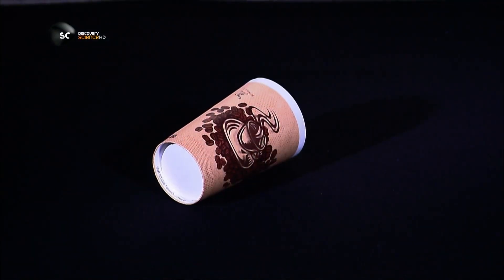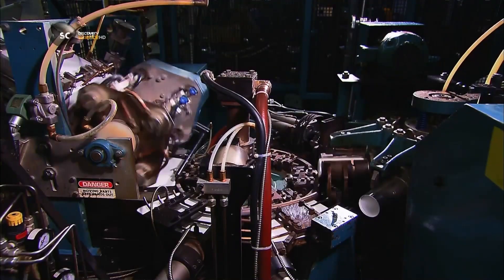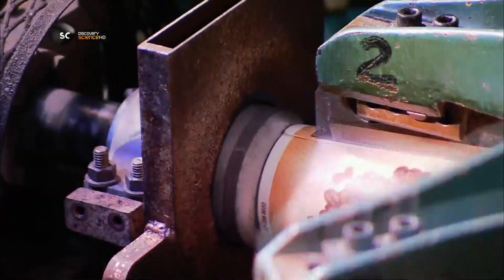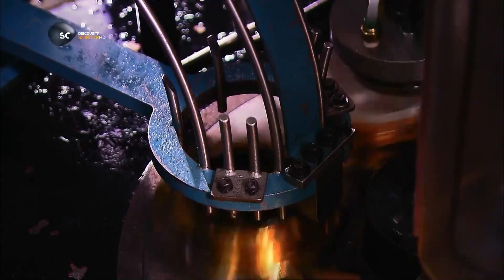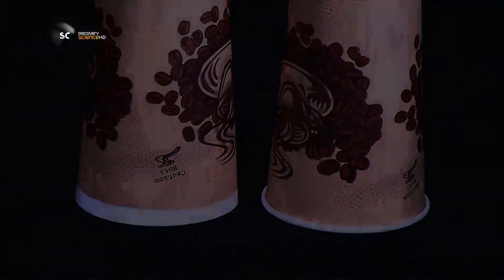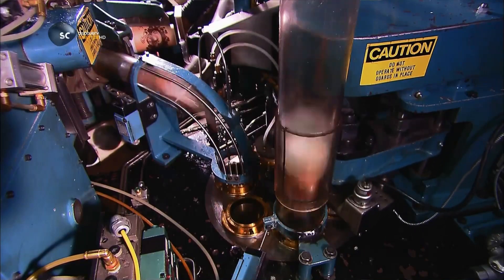Its life will surely be empty without one, so that goes on next. Bottoms are shoved into the cups and heat sealed in place by melting the plastic backing on the unprinted side of the paper. Then cups fall down a chute to the next operation. A hot tool curls the edge of each cup into a rim, allowing you to take a sip without spilling.